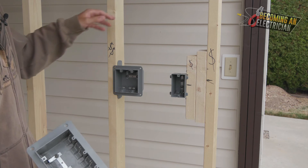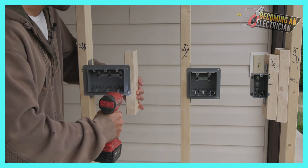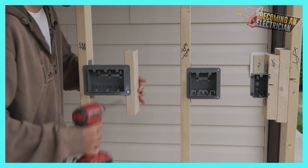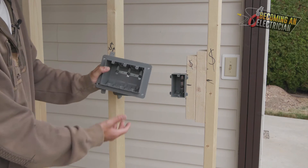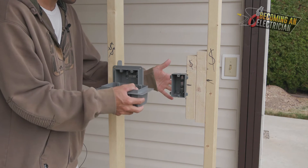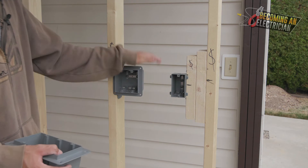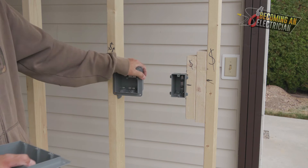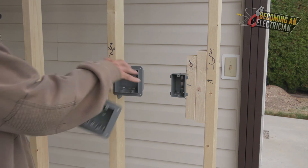In the next video we'll quickly cover how to install a three-gang. It's the exact same as the two-gang, except you screw a scab in on the other side. That allows it so when they drywall both sides of the wall it sandwiches together for a solid install. You do not need to do that for a two-gang — that only happens with a three-gang.